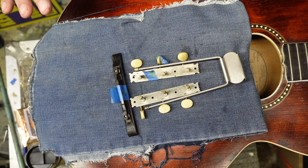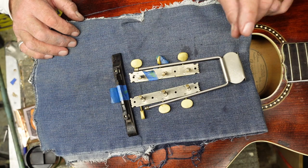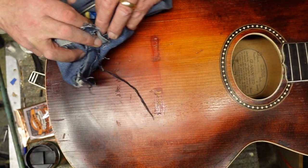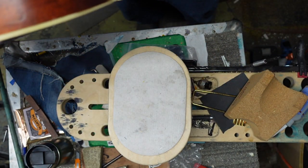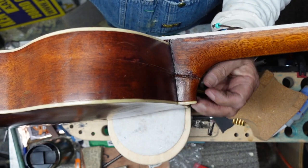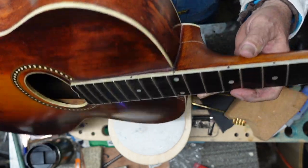So that's the original parts. What I think is happening is this guitar has twisted over the years. One side of the crack at the neck is opening a little bit, the other side is closing, and the body is twisting slightly. These cracks are an adjustment to what's going on with the neck. I don't want to just clamp it — you can see the split right there is several millimeters wide on one side, not so much on the other, running at an angle.